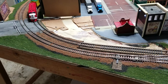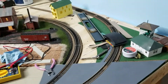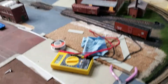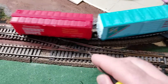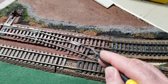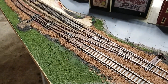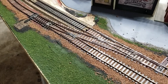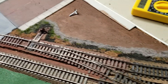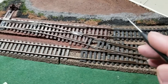I took a couple of steps back because I had laid this down here and got that working okay. But I couldn't run the trains through here — I had no power here and wasn't sure why. Because those two are the exact same switch and I don't have any problem with those. Those have power here and here, no problem. This one I was having problems with, so I soldered a wire from here to here. That fixed it.